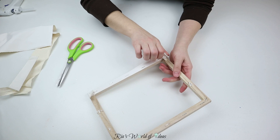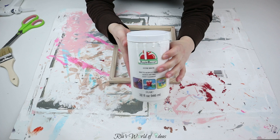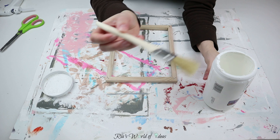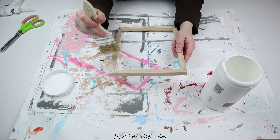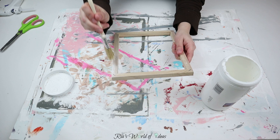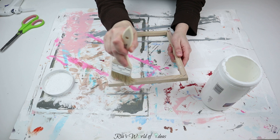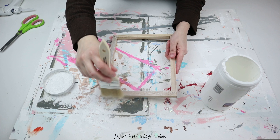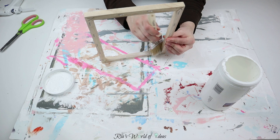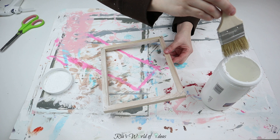This piece of wood is unfinished so it takes stain very well, but I'm gonna use white matte paint and do a dry brushing effect like I've done in other DIYs. I wanted that natural wood underneath with a little bit of white showing to age it and give a whitewash look. You can also dilute brown, red, or gray paint in water and paint it onto the wood — it looks just like wood stain. That's how I save money instead of buying actual stain.